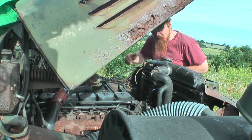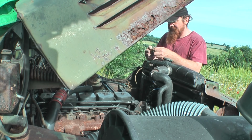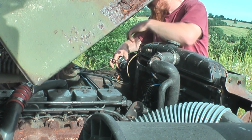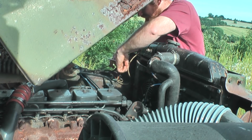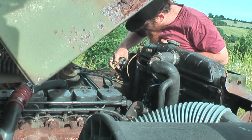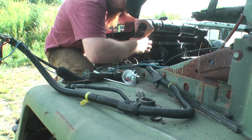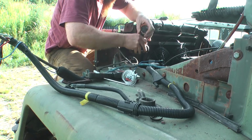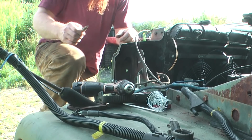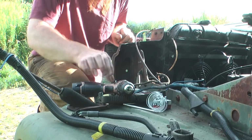Cool. Next step then is to install the little thermostat. And that will sit down there. Like I say, that probe up to there, and then the fan wiring comes in at the bottom. And I think that'll be quite a safe place to put it. That made the initial holes. The step drill is a much better bet for going through thin stuff like this.